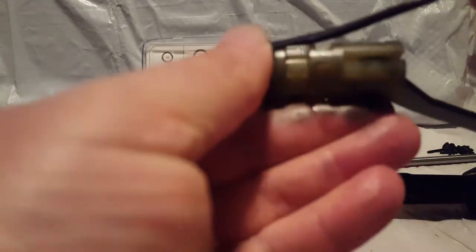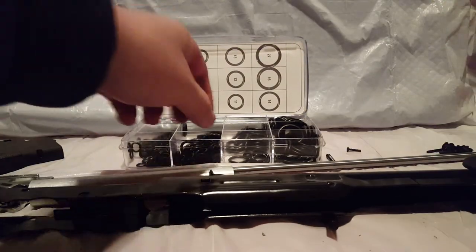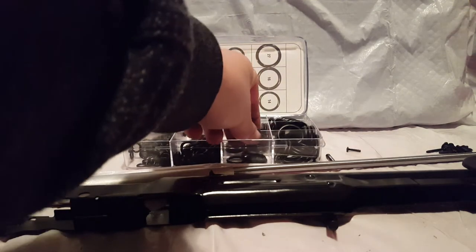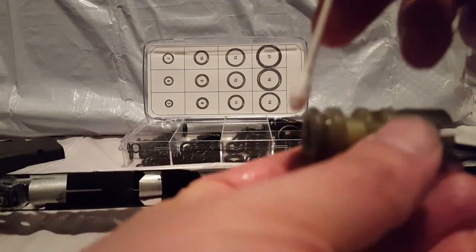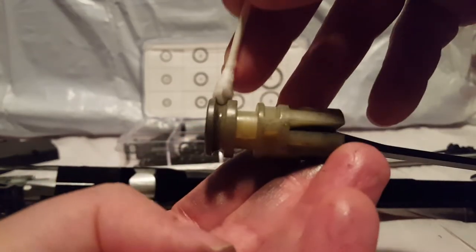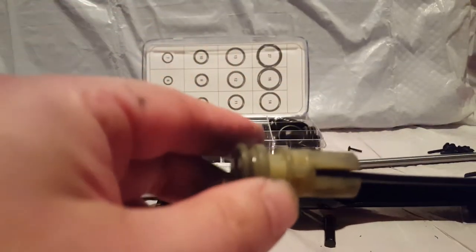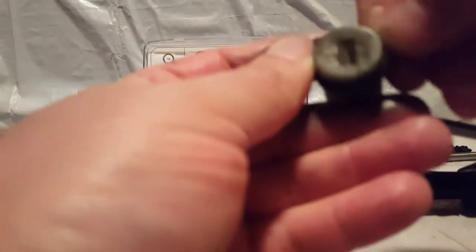Then we get under here for that O-ring. Remember, that's number 11 out of your kit. We're going to assume that's trashed and toss that. Then we get up to your kit, get your number 11 out. So number 11 right there — that's where you want to get that. Take the Q-tip and clean that off really well. Get in there and scrub that out because you don't know what type of oil they used. Scrub that crevice out and the crevice where the wiper went. Then we proceed: you get your new number 11 out and only use your fingers to put that thing back on. There's no need to use a tool — it's really unnecessary, and it goes on pretty nicely.